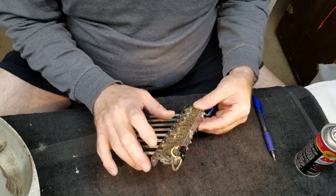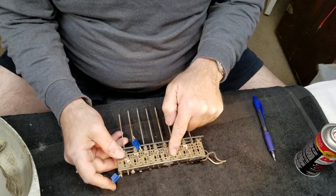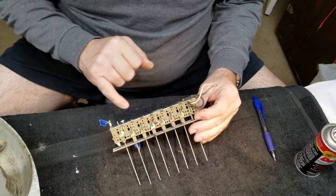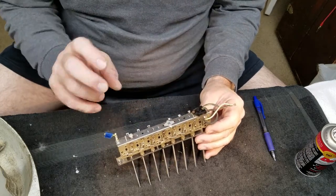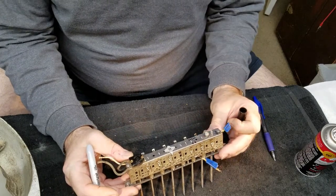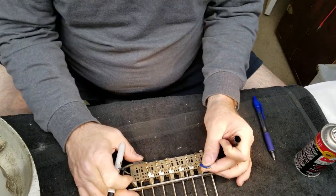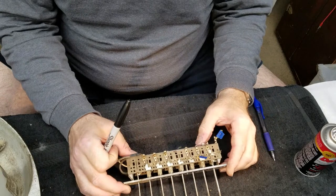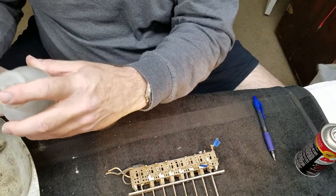Before I use the Deoxit, I'm going to remove solder from the places where I have had wires connected that I want to reconnect - these three places here and this ground connection. I'm going to leave the wires to the power switch connected and just strip them back and splice them together with new wire. I'll probably solder a wire to that and join the two wires together in the chassis - about four inches long - so I can mount this thing, then wire it up, put some shrink tubing over it, and that becomes a much easier job of putting this thing back in.